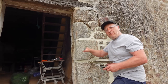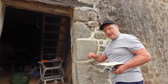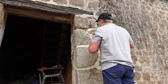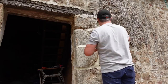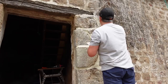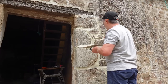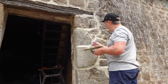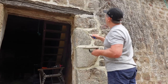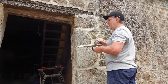It's really important that you work it right in, right into the gap. Fill it right up. Scrape off the excess and then just before it sets, go over it with a brush. The main priority now is to get as much as I can in there, get the gap filled up. And like I say, afterwards we'll tidy up and brush it off. Just get it in there — the more you play with it, the worse it will be. Just don't be scared, just get it in there.